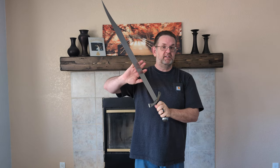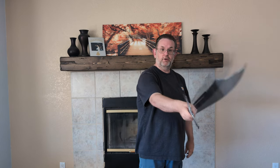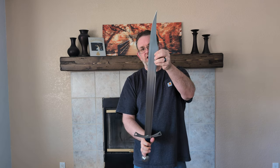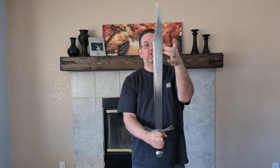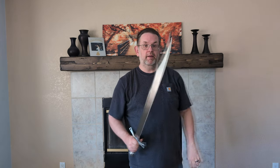This makes for a very nimble sword — I can move it around very easily with very little effort. I can put the tip pretty much where I want to without very much effort at all. If we look at how the sword flexes, it definitely has some flex to it, not a ton — single-edged swords usually have considerably less flex than double-edged swords. But most of the flex starts right where the spine starts narrowing, which makes a lot of sense. You want the blade to be stiff in the strong of the blade, the lower half, because that keeps the percussion nodes in the right spot. The percussion nodes are right around where you want to be cutting, and also where the blade is just about the widest it can be, which helps with the edge angle for making better cuts.